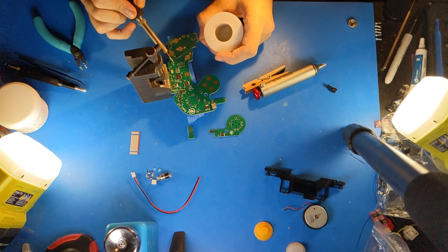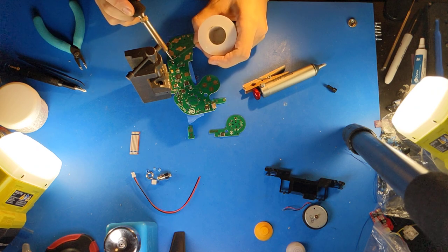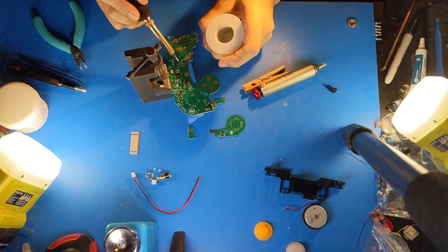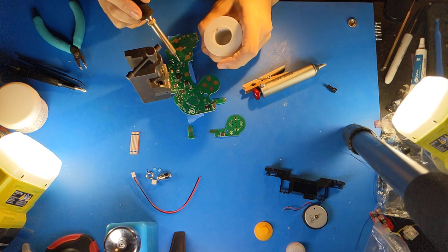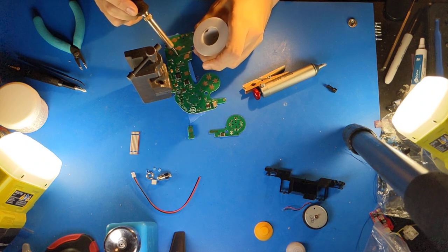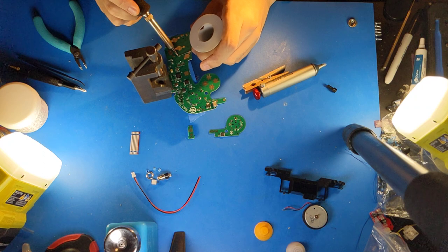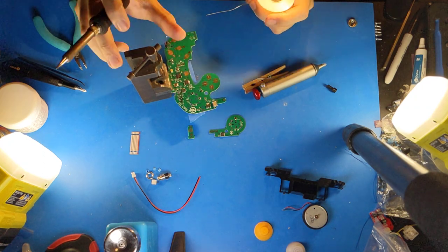When using a soldering iron, it's very important to have an iron that controls its temperature via some sort of active feedback mechanism. When a soldering iron is uncontrolled, it gets too cold when you're using it too much, and too hot when you're not using it. And when it's too hot, you'll burn the board, and when it's too cold, it takes too long to solder, and you'll counterintuitively also burn the board.